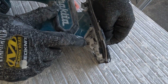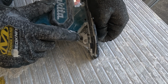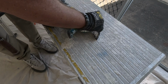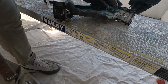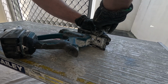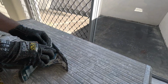When you have a fresh blade, if you zoom in here, it has the millimeters here. So we're going to set it just over the 12 millimeter. Perfect. So it doesn't go through. If any cables are resting on the ceiling, we're not going to be causing any problem. So carefully tighten that up. I have stripped these before, so you do want to be careful. Okay, stick it back in there.